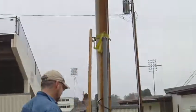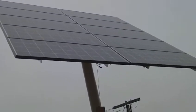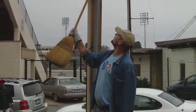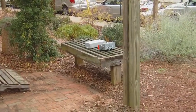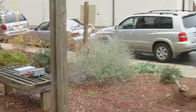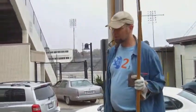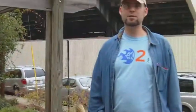If you look up above me, we have a 1.3 kilowatt solar array — we just put this up, it's on a six-inch pole. We're about to put the additional components here, which you see over there on the step. We've got a combiner box and a cutoff switch. That'll then run down through here under the ground to the box, and on the interior we're going to have our inverter and batteries to power all of this.